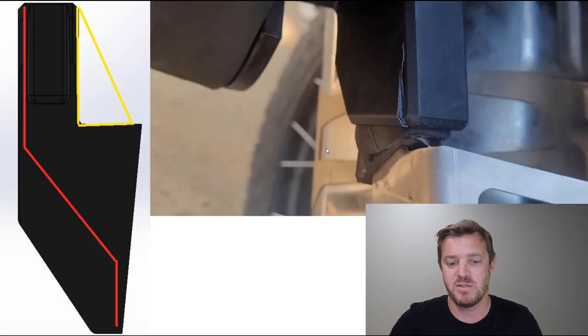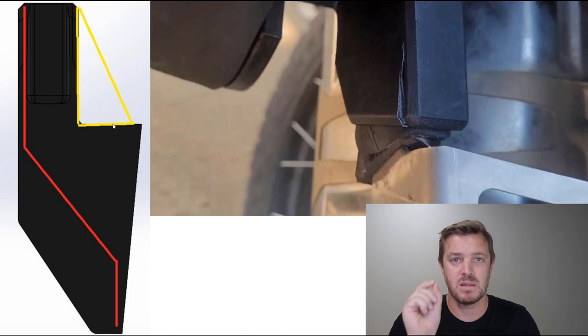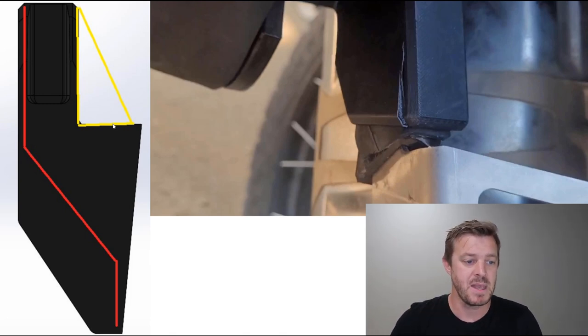For the foot area, I told you before, we found out where things break, and when we find out where things break, we can reinforce them or make them weaker. But we're going to reinforce this part because we don't want it to break, because it has no carry-on effect to any other parts. So what we can do is find out these angles here and make them better angles. With angles, we can strengthen parts. We can increase the wall thickness of this plastic part here.